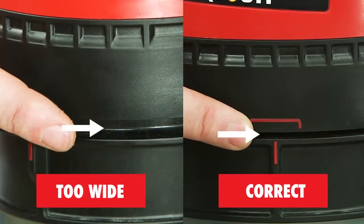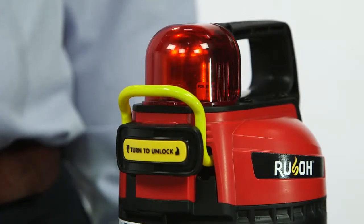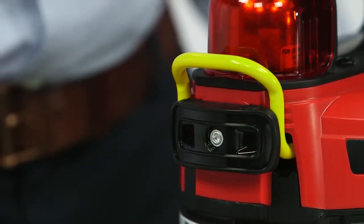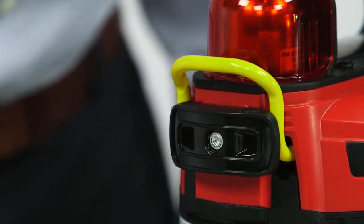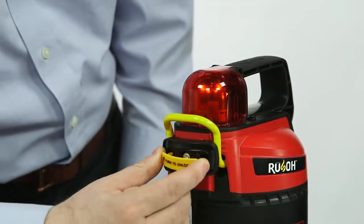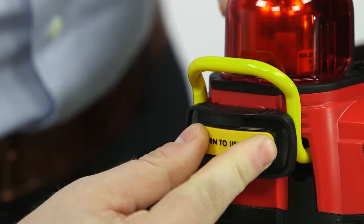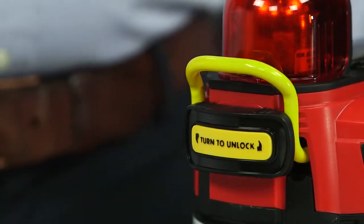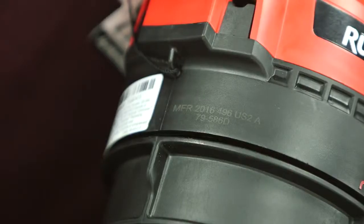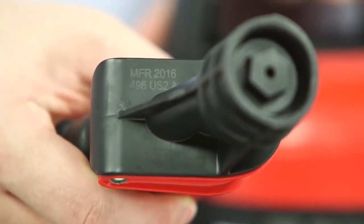With just a very narrow gap between the head and the cartridge, verify that the tamper seal is intact and in place. If it's broken or missing, replace it with a new tamper seal. Position the new tamper seal so that the text is right-side up and the snap hooks align with the hook openings. Using two fingers, gently press the tamper seal arrows until the seal locks into position on both sides of the lock. Check the manufacturer years marked on the agent cartridge, discharge head, and valve assembly. If any are more than 12 years old, replace the extinguisher.